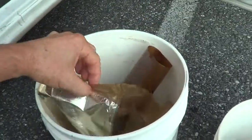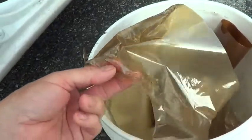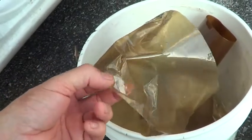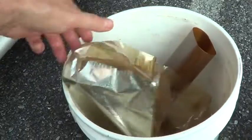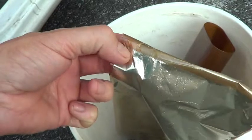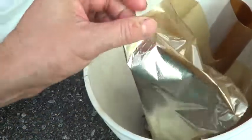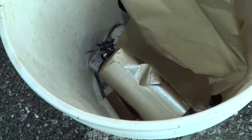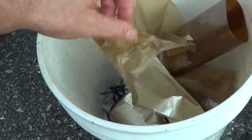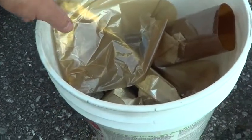Oh, that smell — it's got a rank volatile smell to it. It's just a thick plastic insulator, that's why the old ones didn't fail. The aluminum seems pretty thin but I can't separate it from the insulator. The thicker the plate spacing, the larger you have to make the capacitor — this thing is huge, about ten times bigger than a modern capacitor for the equivalent capacitance value.